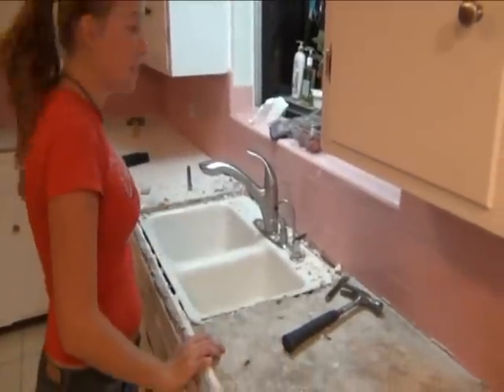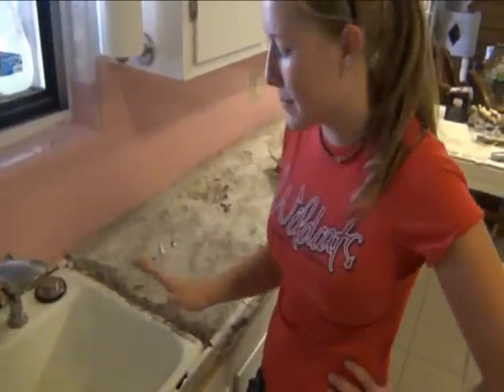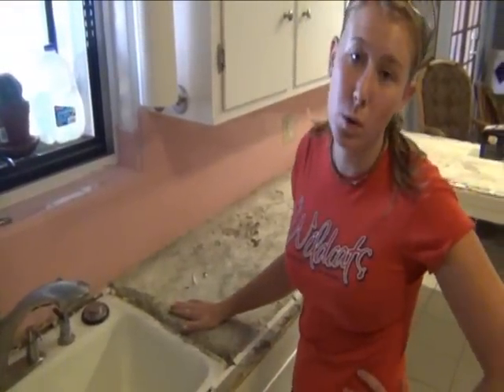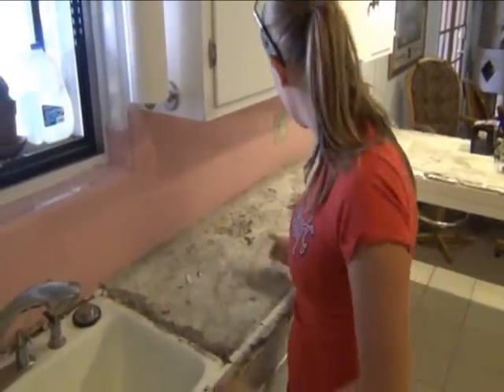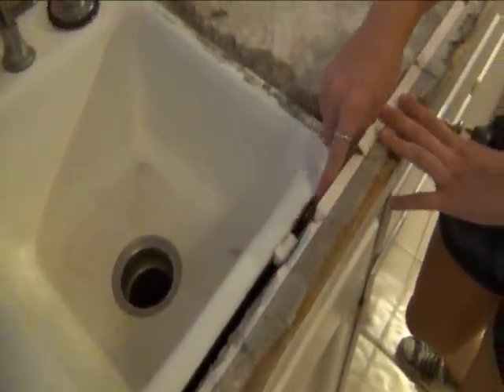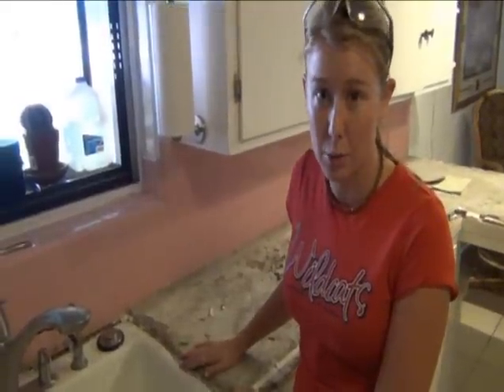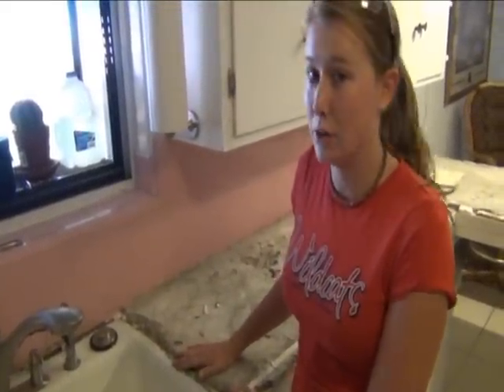That's a wrap for tonight. It's been about three hours and we've gotten up all the tile on the counters. I've done some thinking and I believe the best thing to do is strip the counter of all the old concrete. As you can see, we've gone down to the chicken wire in a few places and we have major gaps along the sink. So we're going to strip the concrete and then put down new plywood and concrete board so that we have a better base for our granite tile.